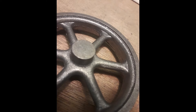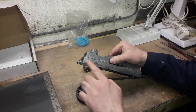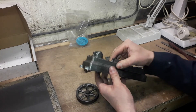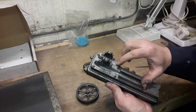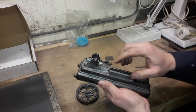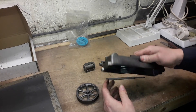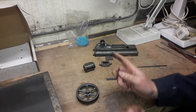The same on the main casting - your flashing marks, also where the inlet and outlet for the cast iron into the mould. Just took those down, went around, cleaned up all the little marks. You can see we had a bad one on there - there was a bit of stuff stuck on it - just cleaned it all up, and then it's ready for paint really.